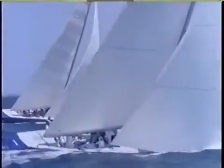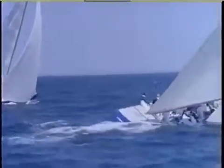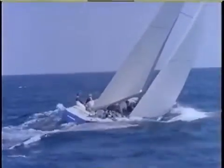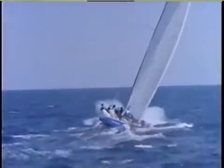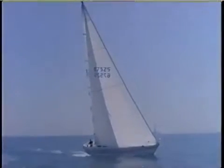In rougher seas like these, a deeper sail with a rounder entry is required to provide more power and make the sail more forgiving and easier to trim. To achieve this shape, the backstay is eased to add depth, but halyard tension is maintained to keep the draft forward. This is a power shape rather than a high pointing shape.